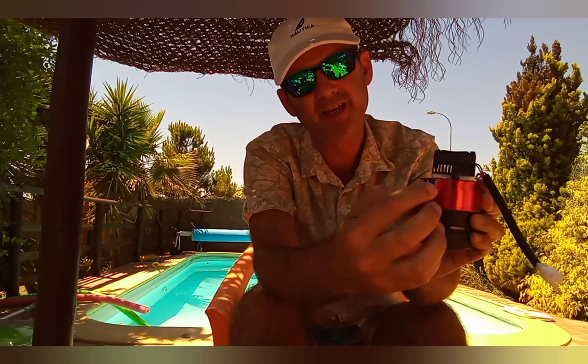It's a set of a 5 volt fan, 40 millimeters by 40 millimeters, and it came with a smaller heat sink, which I used to experiment between the camera and the peltier, but it loses efficiency. It's better to put the peltier directly on the surface of the camera.